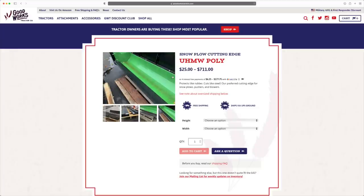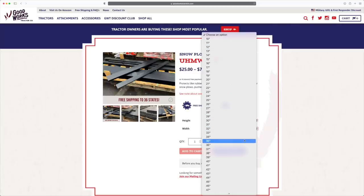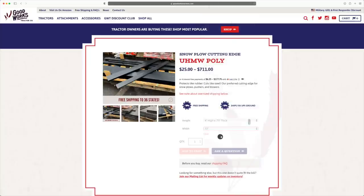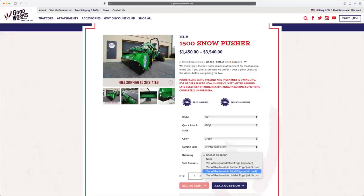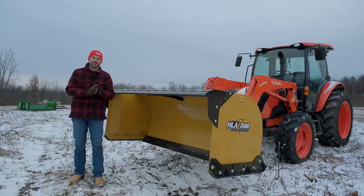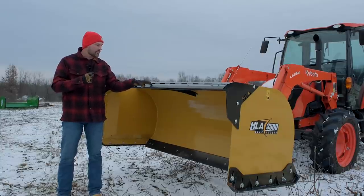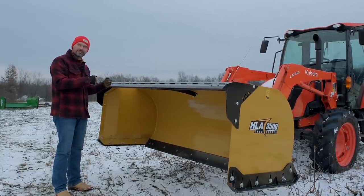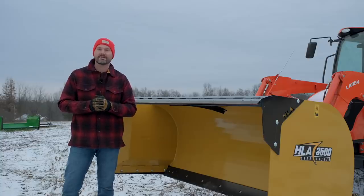We're pretty big on a material called UHMW - a poly or hard plastic. The easy way to sum it up: it cuts like steel but protects like rubber. It's a great solution for paved surfaces and concrete driveways where you really want to scrape well. Rubber doesn't scrape well at all, but steel is very abrasive and can chip and damage more delicate surfaces. We went out and sourced UHMW skid runners available for an upcharge. For complete driveway protection, I'd suggest UHMW skid runners plus UHMW edges on the main cutting edge and the back drag. UHMW is also available for snow plows, buckets, and rear-mounted grader blades. We have quite a few different sizes and can cut to length - we don't drill the holes, so just lay it on, mark it, use it as a template, drill it out with a multipurpose bit, and grab some nuts, bolts, and washers from the hardware store.